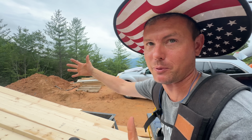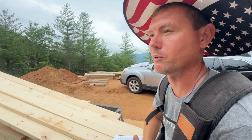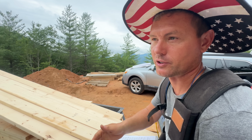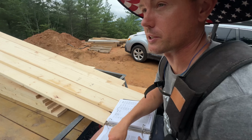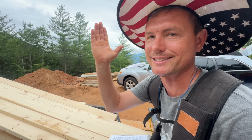And I guess the idea is that you're trying to replace the missing framing where that opening was and condense it and move it to a different location. I've been told before that if you just count how many studs would have been in that wall section, divide that in half and put them in the king stud position. So we could do that right here in the 12-foot opening and see what... I don't think it would be 5 per side because that would be 10 total. That seems a little bit extreme, but this is also in that absolute load-bearing situation where this is not.